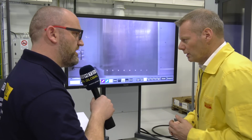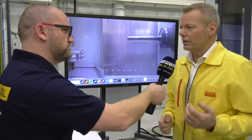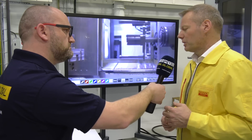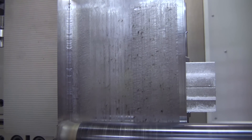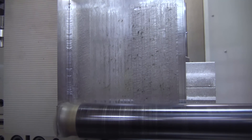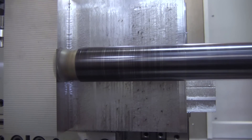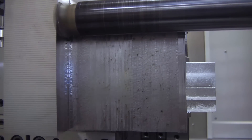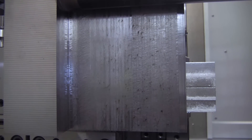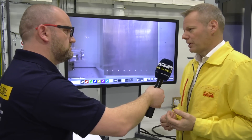And when we compare that to the lightweight cutter, what sort of data is that tool running at? We will run the same cutting speed and feed, but we will increase the depth of cut to 1.5 millimeters instead of one millimeter, which is equal to a productivity increase of 50 percent. And it doesn't seem to be struggling — the noise is much better. And remember, we have been increasing the depth of cut by 50 percent in this case.